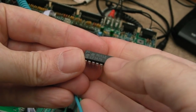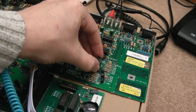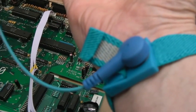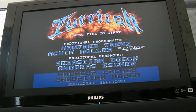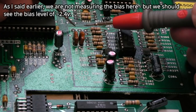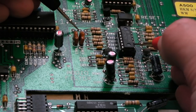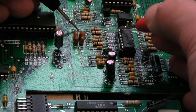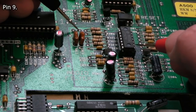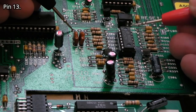So finally I'll fit the replacement op-amp — you can see it's an LF347. That isn't the chip that was originally in this — it's an equivalent; some boards have the LF chip, some have the other. I'll show you the part number in a minute. Pin 1 is up this side here, and I was wearing the ESD wrist strap while we did that. So tested for a number of hours and it's perfect. If you want to measure these bias levels on another A500 board, because you might have these little filter components with these two test pads — if I just measure from the right-hand one there, the second pin down on this side, pin 1 is up here, and if you go all the way around to the next one up on the right-hand side there — that's a dead short, so you can measure voltage there. The other one is the second one down from the top.